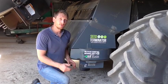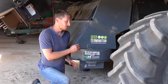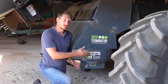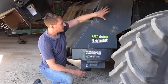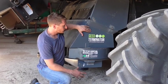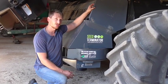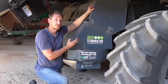The multi-stage hammer mill also uses aero impact technology, which is all about generating low turbulence air flow. We're generating high air flow, but we're doing it without generating huge amounts of turbulence. Turbulence generates heat, which is wasted energy. We want the air flow because the air flow off the sieve basically needs to be matched with the mills — otherwise air flow travels out into the straw and that generates an opportunity for weed seeds to escape. So we have the high air flow and that enables maximum capture of weed seeds.